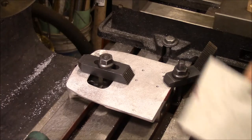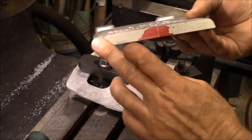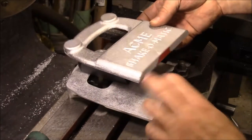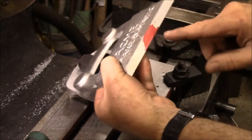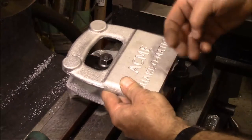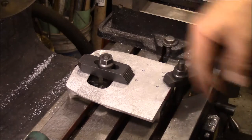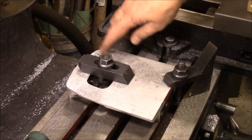Before I did that, I needed some way to reference these two halves together. These edges are flat, so I put some dye on each end, lined them up — lined the bottoms up and got them evened up left to right — and then put a scratch mark right in the middle that matches up between the two. Now if I align myself to that mark for X and Y, that just gives me a way to align it.